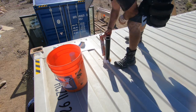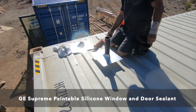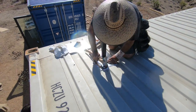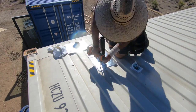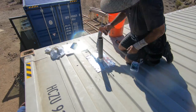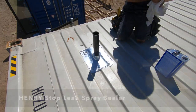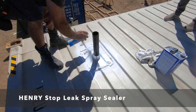While I was working on the doors and windows, Tony started sealing up the roof vents. We need soil stacks to vent areas that have plumbing, and after spray foaming the joints from both the inside and out, Tony screwed down some flashing over the pipes. He generously applied silicone caulk and had to bend the flashing to fit the ribs of the ceiling panels. Once the silicone had cured he cleaned the areas and then sprayed everything with Henry Stop Leak roofing spray.